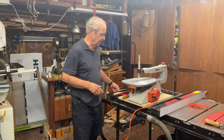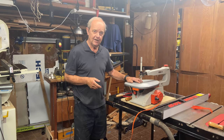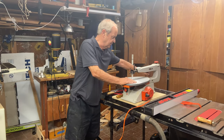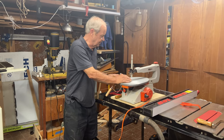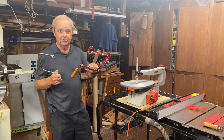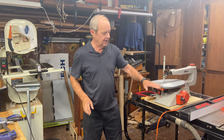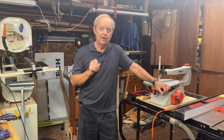Let's recap and summarize. If you want to make fairly tight curved cuts, the easiest tool with the best, smoothest, most pristine result is the scroll saw — though it has limitations in throat size and cutting depth. If you don't have the budget for a scroll saw, go with a coping saw or fret saw, as they are much less expensive and take up virtually no space in your shop. However, they are more difficult to use, require a higher skill level, and require some practice. We hope this has been helpful — please hit the like button and subscribe for future content.